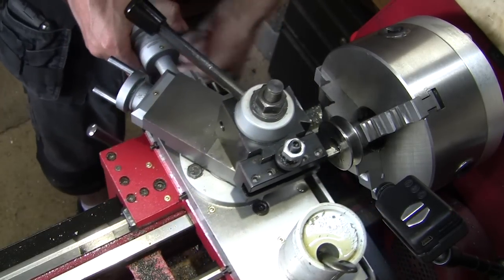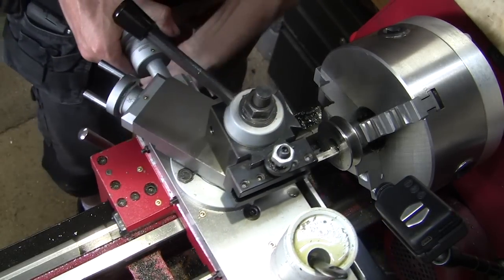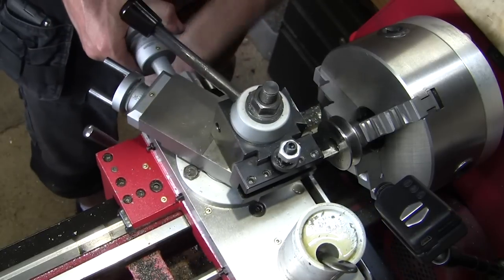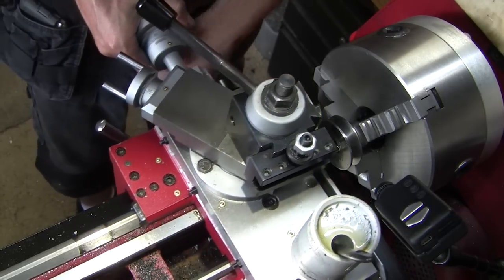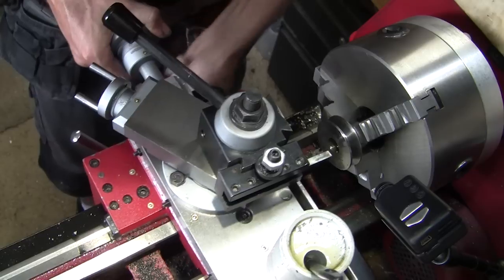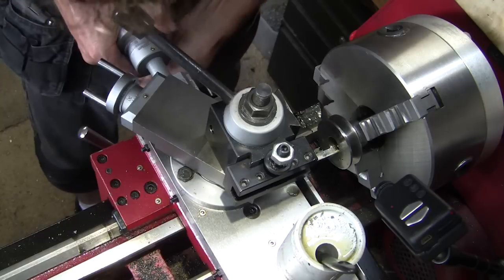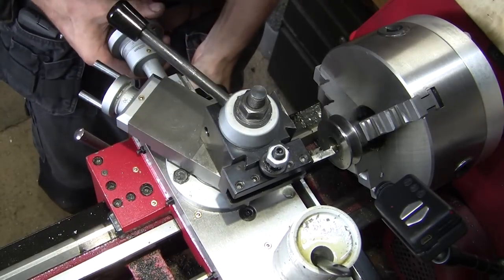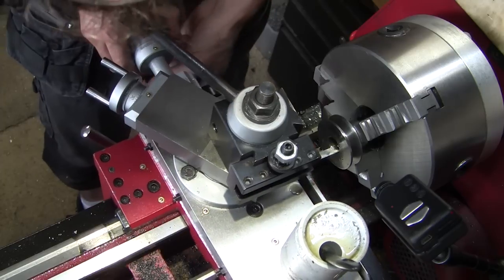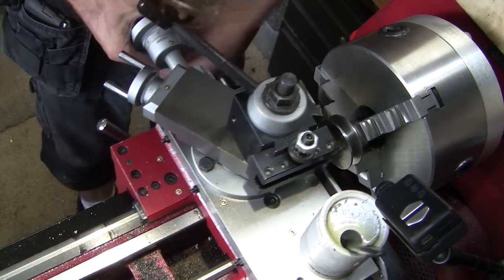It's a good workout on the arm with such a small little crank on the saddle with the C6. You can also see I've got the tool raked forward a little bit so it doesn't drag the tool all the way through. And as you can see there I just rolled up a burr — I've had to back out and clear off.